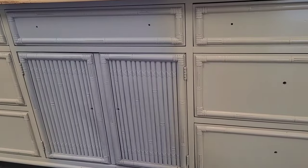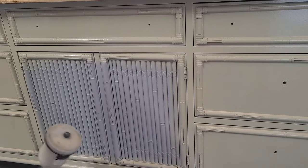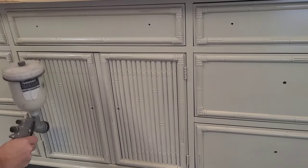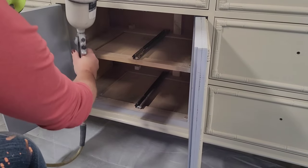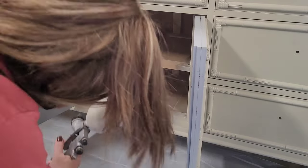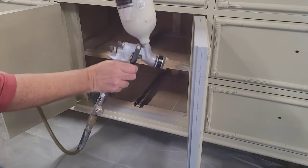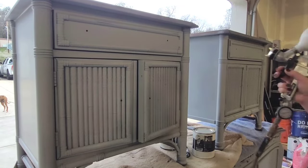Paint sprayers can be different — everyone might like a slightly different consistency. You can dilute this up to 10% if needed, but I didn't find that necessary. The One Hour Enamel can be brushed or rolled on, but I really like how it sprays — so beautifully. The sprayer I'm using is a Husky gun attached to a DeWalt compressor; I chose this because it's easily accessible in my workspace and usually always connected. I also have my Apollo sprayer and I'll pull that out on occasion. I sprayed with the drawers inside the body and also opened up the doors to get inside and around the frame.